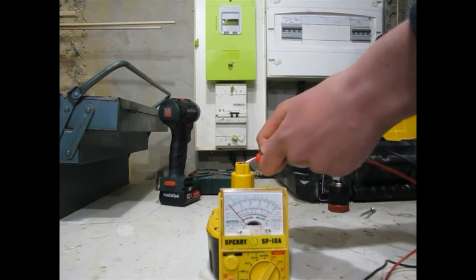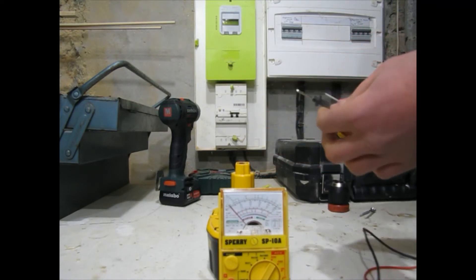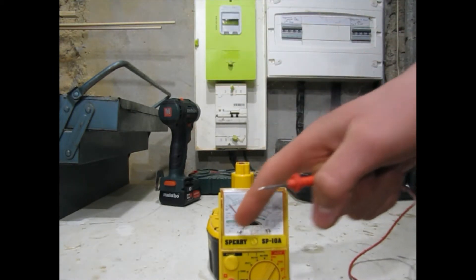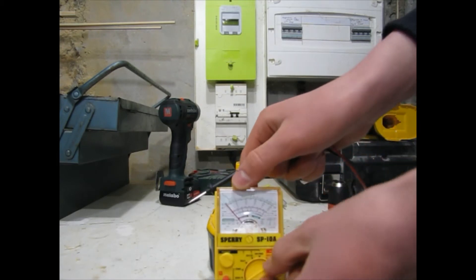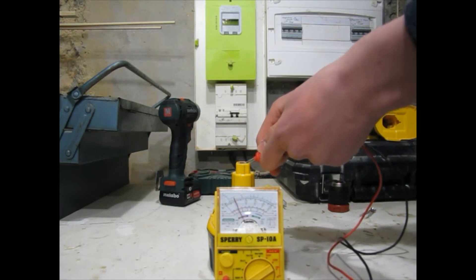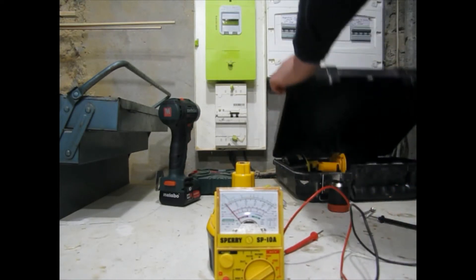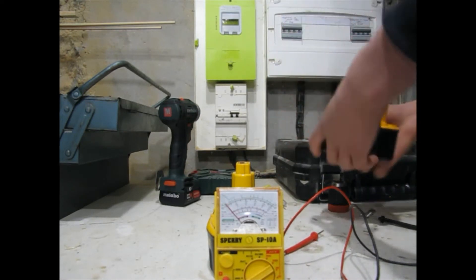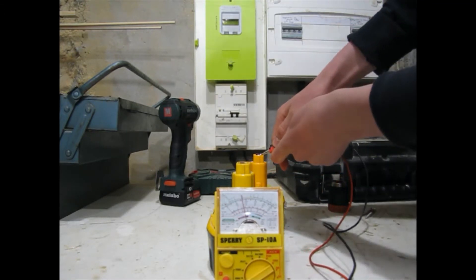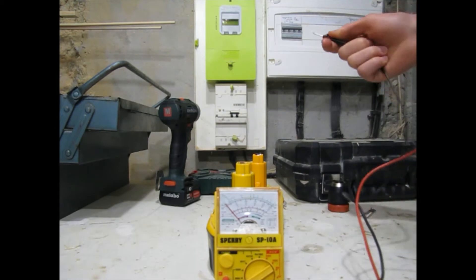You can see the back - it's almost 10 volts. With this analog meter, if you mix up plus and minus, all that happens is your wand goes the other way. You could also set it to 50 volts. I'll show you a fully charged good battery - a charging battery. See, it goes up to about 15, somewhere between 15 and 17 volts.